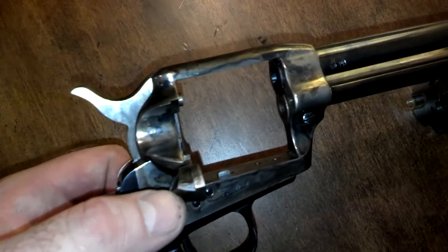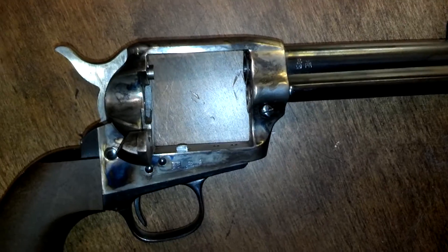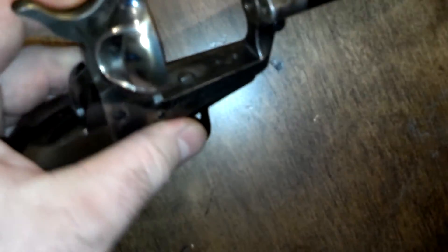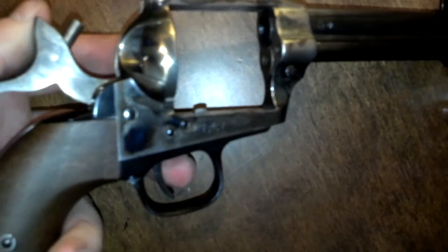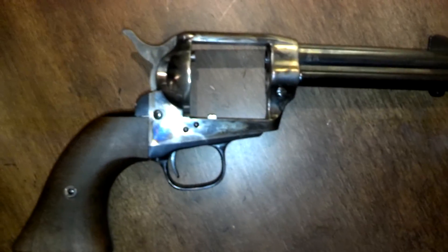I think you can do it without turning the revolver into a machine gun — it's just going to be a little bit more work than he'd anticipated, and that's why I have this. It's going to be a .45 caliber single action army. I'm going to switch out the cylinder, modify the cylinder catch if necessary, modify the frame on a mill, add a bushing to it, and adapt the firing pin. That should be everything it takes to make this into a functioning cartridge firearm.